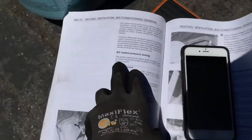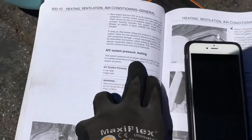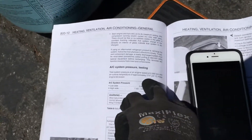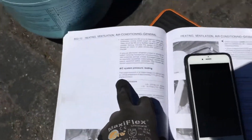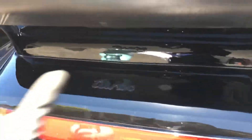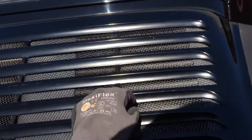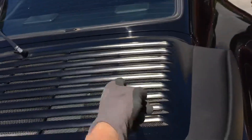As you can see here, test system pressures with engine speed at 2,000 RPMs, outside temperature approximately 77 degrees. Well, we're actually 66 degrees right now. Keep engine hood closed, engine lid closed. The engine lid must be closed when you do this because it relies on the big fan pulling air like a vacuum cleaner right over this evaporator that's located right here. If you have it up, you have no airflow.